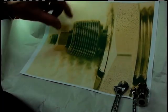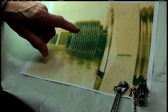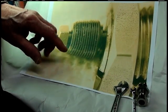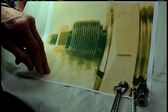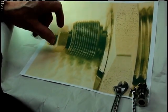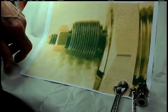Before repairing a head, there's a couple things you must consider. The die rollers must be in good condition. If they're damaged, don't waste time. You won't get good spokes out of it. And the pins should be firm in there so the holes are in good condition.